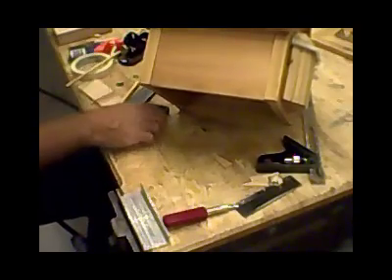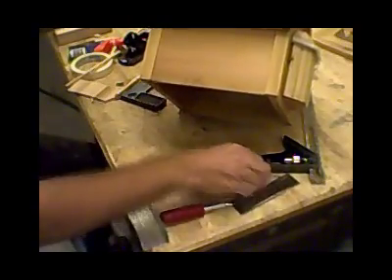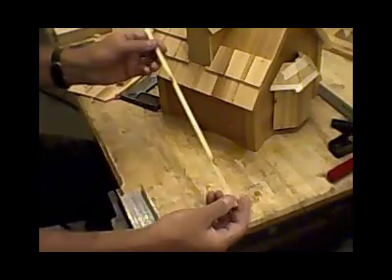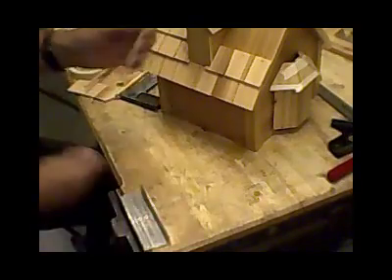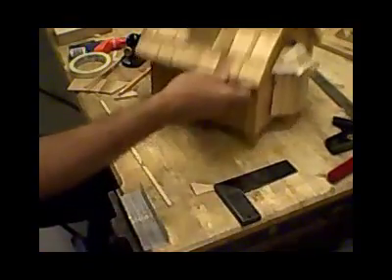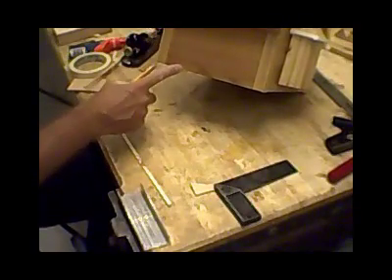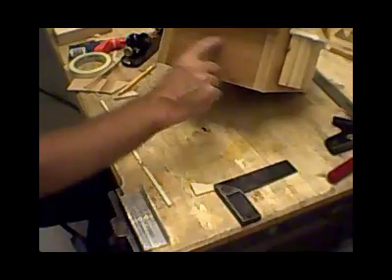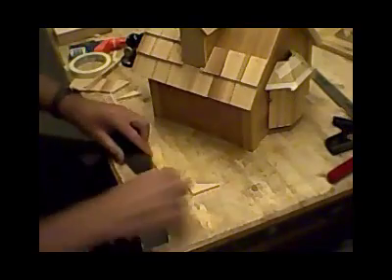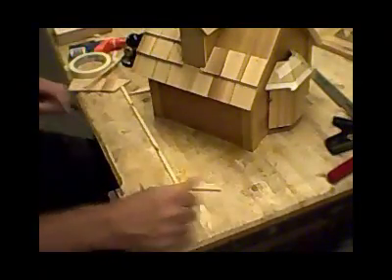The difference between doors and windows is that the door does not have a little board that goes across the bottom — the door itself goes all the way to the bottom. The windows have a framing member on the bottom. So what we're going to do is take our little pieces of material and mark them and cut a bunch of two-inch pieces. We're going to have at least five two-inch pieces and then put the other pieces in between. So we're going to mark two inches, and if you use a longer ruler, it'll make things a little bit easier.